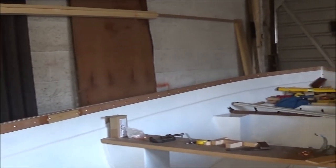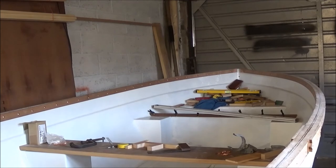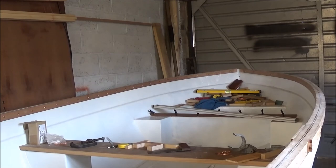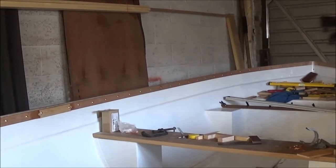All the nails are in now up to the front end, and once I get that block on there are just two more nails to put in through the block to finish off the nailing. I decided in the end to do it at 120mm spacings. On wooden boats I think they do them every 100mm or 4 inches, but I figured 120mm shows attention to detail — 100mm shows obsession. So that's what I went with.